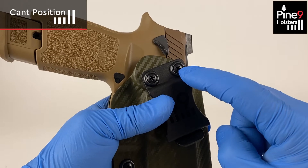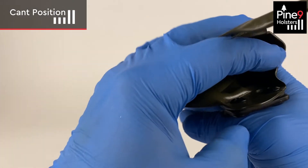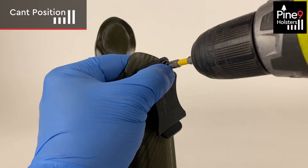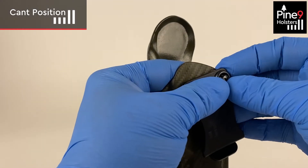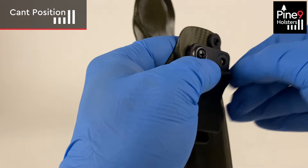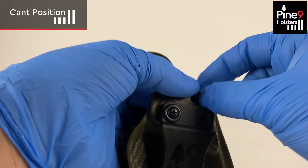all you have to do is remove this one screw and I'll show you how to do that right now. I put my finger on this nut here, take my screwdriver, and pull that out. I usually hold it with my thumb because I'm simply going to pivot — pivot this down and out of the way. Remove this bushing, and take this nut out.